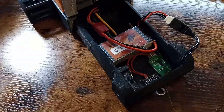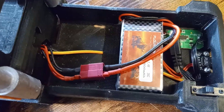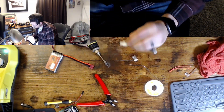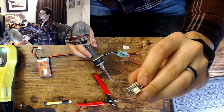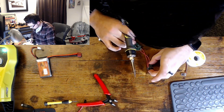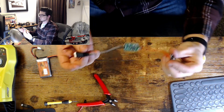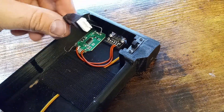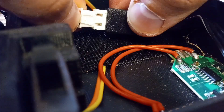I was able to find a battery that's the exact right size and shape to fit sideways inside of the chassis. Thanks to the surplus of room inside the new larger chassis, I opted to put the battery underneath the bed of the truck instead to make it look a little bit more streamlined. To charge the new battery while on the vehicle, I also used an off-the-shelf 2-cell USB balance charger. I desoldered the USB-A plug and ran leader wires for my fancy chassis-mounted USB-C jack. This worked great, and was a lot cheaper than some of the more purpose-built single-cell charger circuits I've used in the past.